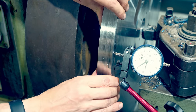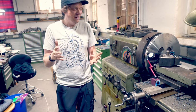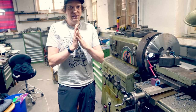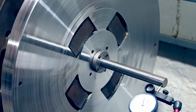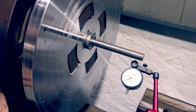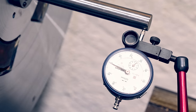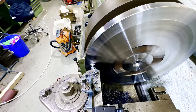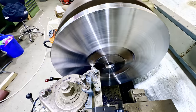Lucas is here — it looks like it wasn't really tight, right? It wasn't tight. And now when we go close to the indicator — wow, what a difference! I can still flex it a tenth of a millimeter if I put my whole body weight. The four-jaw chuck hadn't been used for 10 years, so of course there's some running in of something like this. Now I'm making sure it's really tight on there. Wow, what a difference — I almost can't move the meter anymore. Not even a hundredth of a millimeter if I put all I have.